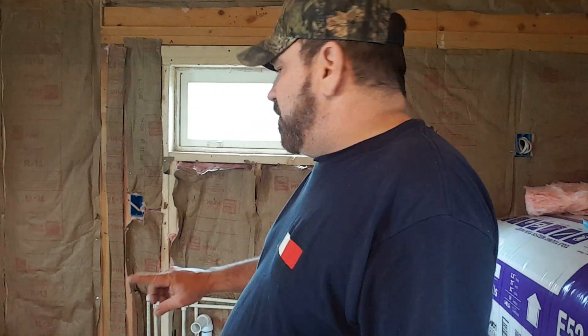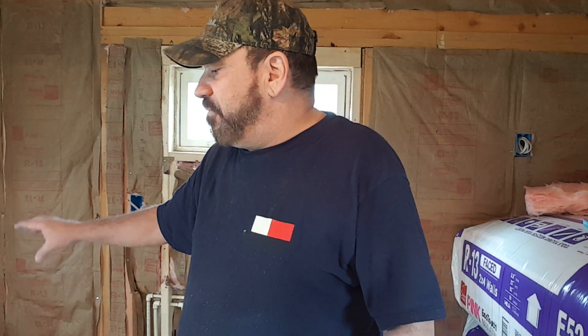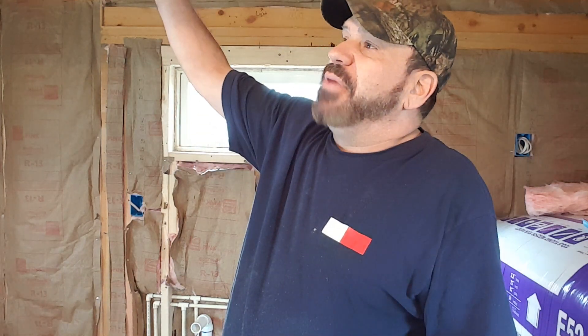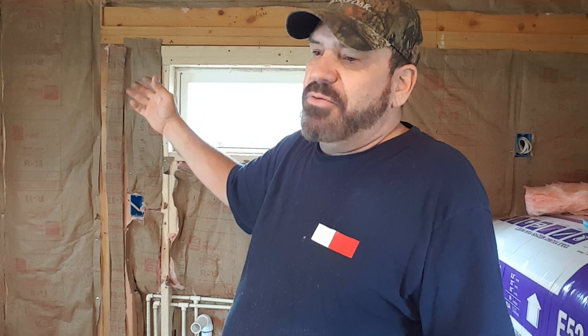I had somebody that I follow on their channel ask me about the drain — do you not have to have a sewage drain? I did put in my two sewage pipes here, and I'll have a commode and a shower that has to go in. But the drain vent will be outside. Once I connect all four of my drains together, there will be a vent outside going up. I have a loft above and I don't have anywhere really good to run a vent for my drain through, so my vent will be on the outside. I'll try to paint it whatever color I can to make it look the best — I might even build a little box around it.